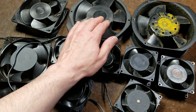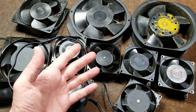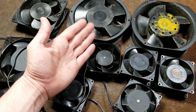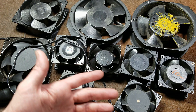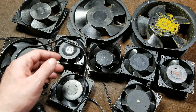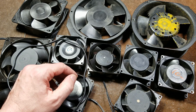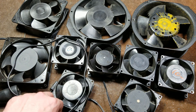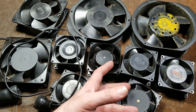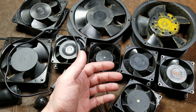So these are really great if you have a shop or a shed or a garage that in the summer gets super hot and you just want a ventilation fan. These types of computer and electronic fans are a great option just because they're simple — they run off 120 volts AC. All you have to do is put a hole in the wall, maybe put some louvers on, get a screen for it, and then connect it up to a light switch. You don't need to get special power supplies, and you don't have to worry about jet-engine-loud fans unless you really want those.